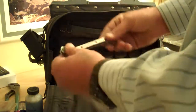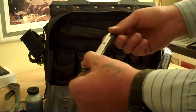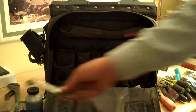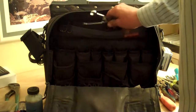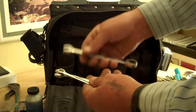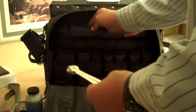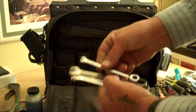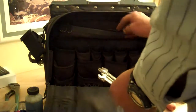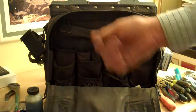In here, service valve wrench that'll work your torch tank, key sets for blower wheels, a bunch of stuff this stuff works on. So everybody, I'm sure all the service guys have these. And then up here, I got a whole set of these, but these are the ratchet type wrenches, but I got the most common sizes that I carry. I don't want to get too crazy with it, but I've got quarter, 5/16, 3/8, 7/16. Other little chucks and stuff, service port tool there.